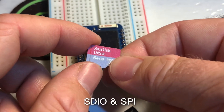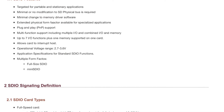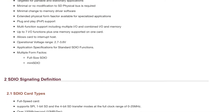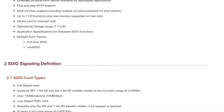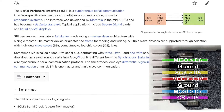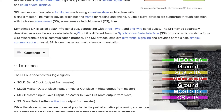There are actually two ways to talk to these cards. The first is called SDIO mode, which is what most of your consumer electronics, like cameras, will use. It's a whole lot faster, but it's also a whole lot harder to use. The second mode is what we're using, which is just plain old SPI. It's pretty easy to use for most microcontrollers.